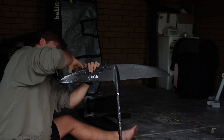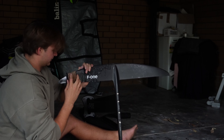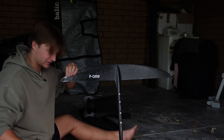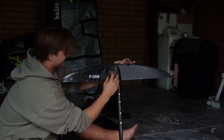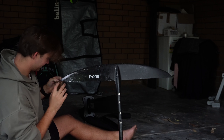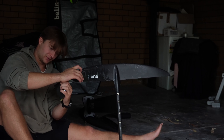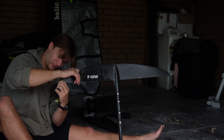Still working on this other side — it's had a little bit more excess than the bottom side of the foil. From my experience I've been taught to only run along the chord of the foil when sanding as much as possible, so that the minor microscopic scratches you're putting in go the length of the chord. I think this is one of those things where people have a lot of different thoughts, and potentially we could be starting a bit of a war in the comments — interested in your guys' thoughts on different sanding techniques and what achieves best performance.